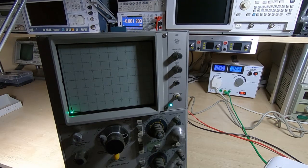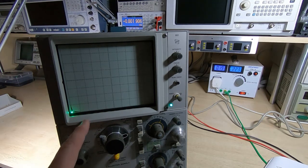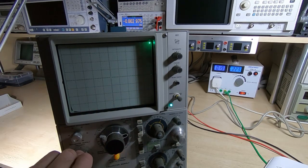We're now looking at polarity compensation. This is when we go from a positive polarity signal to negative and check that we get a symmetrical step across the display. We've got it set up with the bottom left hand corner of the screen with positive collector supply selected. When I switch this to negative supply, the spot should jump up to exactly the top right hand corner of the screen. And as we can see, that is spot on — no pun intended.